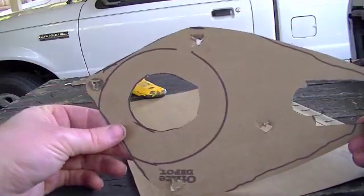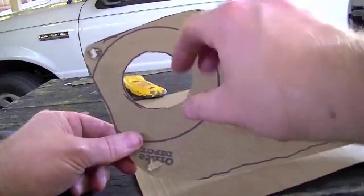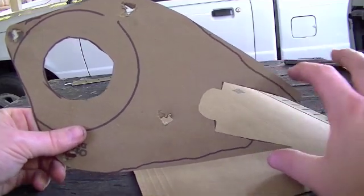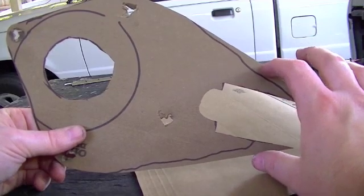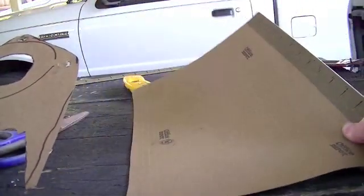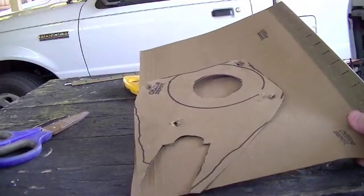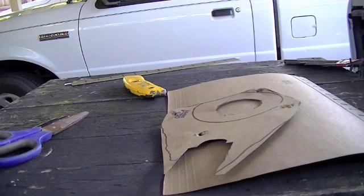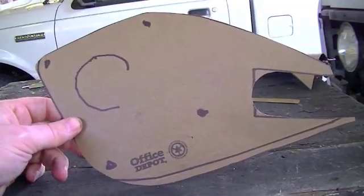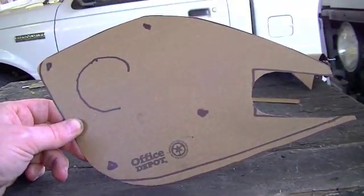We've got our rough template made, and all this really tells us is our rough parameters — the bolt pattern and the diameter we need to cut out in the center to have clearance for the centrifugal clutch, and also the clearance we need around here to clear the bearing and be able to weld that bearing flange retainer onto our extension arm. So what I like to do now is use the other half of my folder and actually make a better, true template that I'm going to transfer to the steel — get this refined and then trace that on there. And here we have our slightly more refined template. I personally work better in steel, so I'm just going to get this rough template drawn onto the steel, get these holes centered up, and then just work the steel.